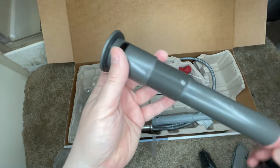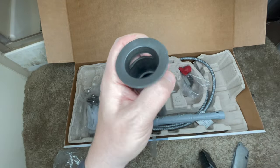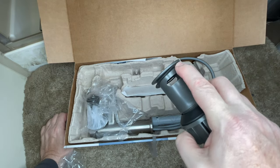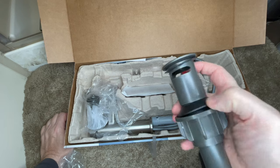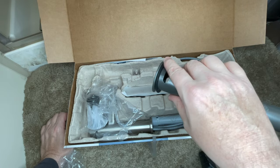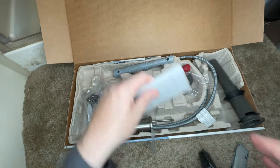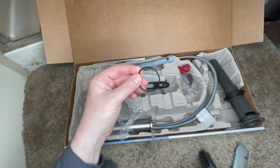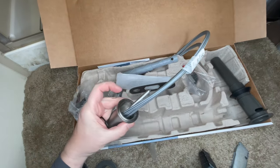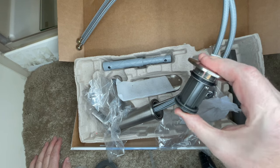Check out this drain — this is all one single piece now, one piece of plastic with a rubber gasket that goes on top of the sink and a rubber gasket that goes on the bottom of the sink. I usually silicone with this plastic type stuff, but let's try it. This plastic piece is super heavy, pretty solid — good job Moen. We're actually just going to be mounting this straight to the countertop, single hole. I've never seen these new things — I didn't know Moen redesigned their drains. Little interesting style, looks pretty good.